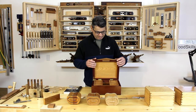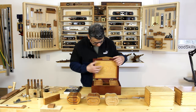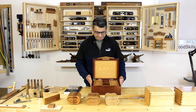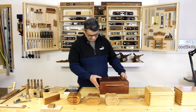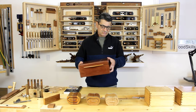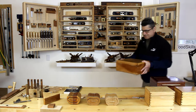I had to develop jigs to create those slip tenons. The hinging is conventional but with a quadrant hinge to keep the lid from going too far back. There's a contrasting shaped handle that I used throughout my more recent boxes from that era. It eventually developed into an engraved brass plate for the client. This was my foray into more advanced box making, and I began marketing these boxes online - on the cusp of the internet - and was actually making some headway with sales.